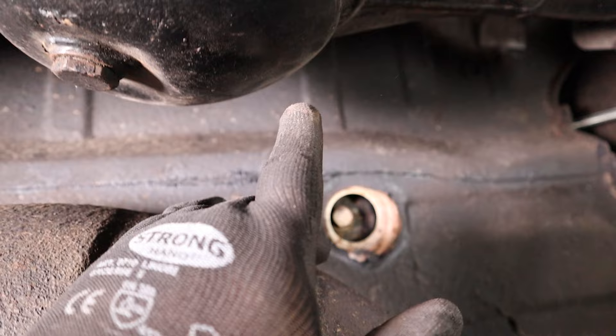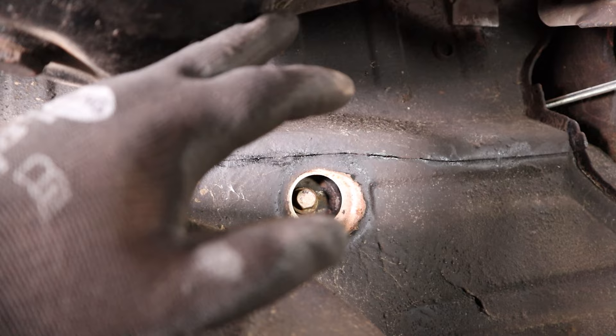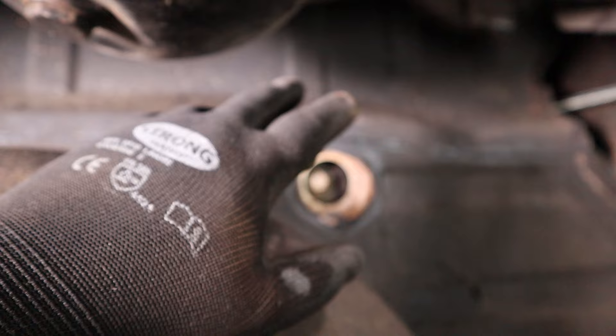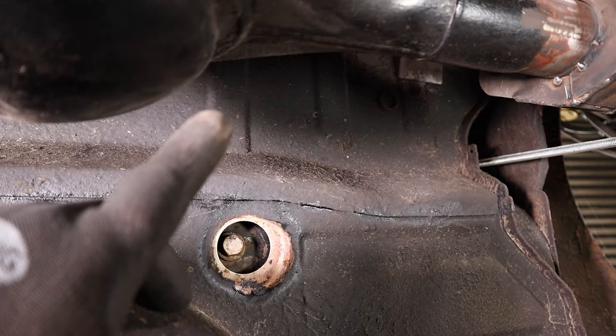What I could do is shift it to the right a little bit - here we have a lot more room. And I could, if I want, put the pivot on the axle itself, or if I have to, I could put it somewhere right here. It does make things a little bit more complicated because the pivot has to be asymmetrical to compensate for the length difference of the rods.